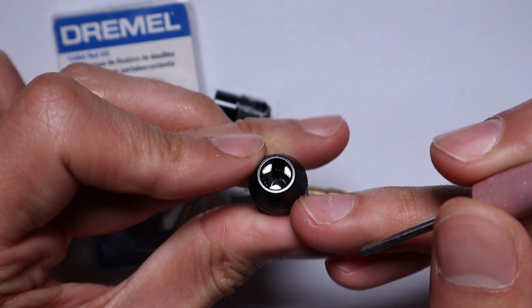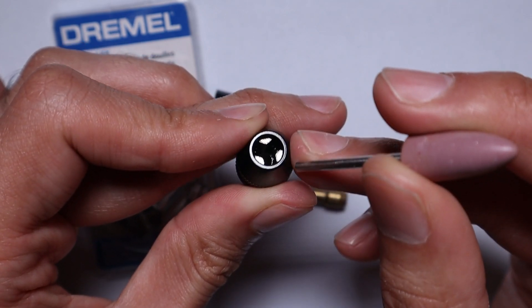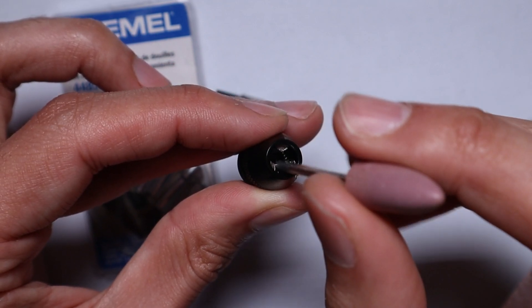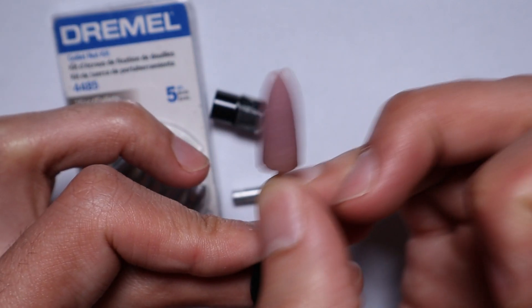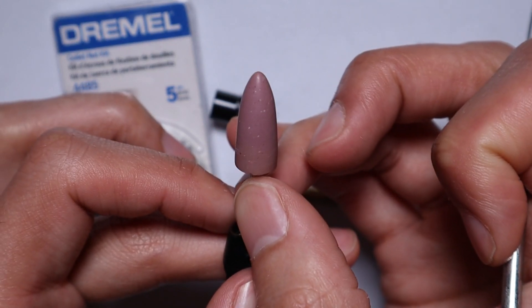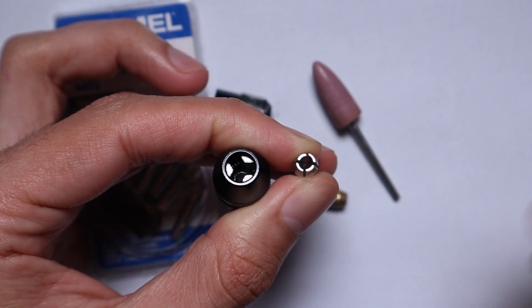With the little jaws of a chuck, they can become misaligned - especially because those springs can get old, seize up, and corrode. What can happen is it starts slipping around, and if you don't clamp it in properly it'll have a little bit of a wobble. You've got to turn it off, unscrew it a bit, move it around until it sits in the right spot, tighten it back up, and wait for it to reach perfect balance. So in terms of grip, you've definitely got a win for the collets.